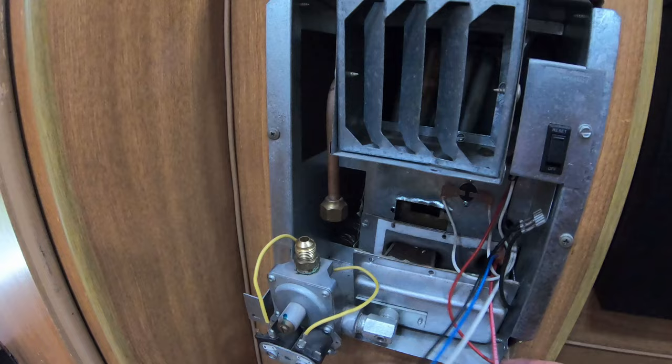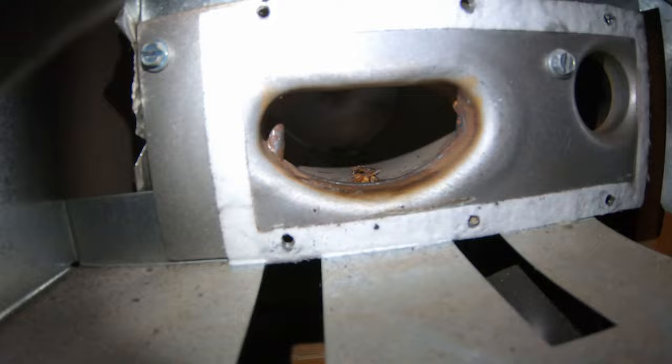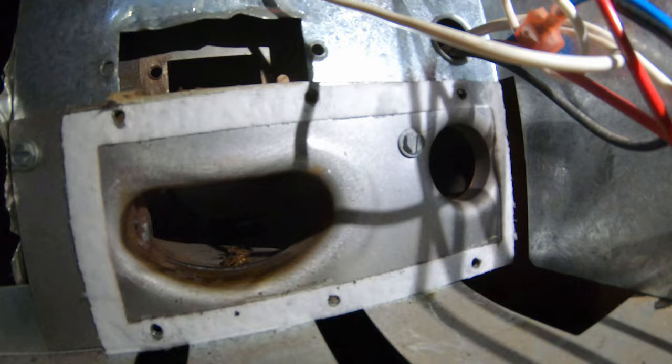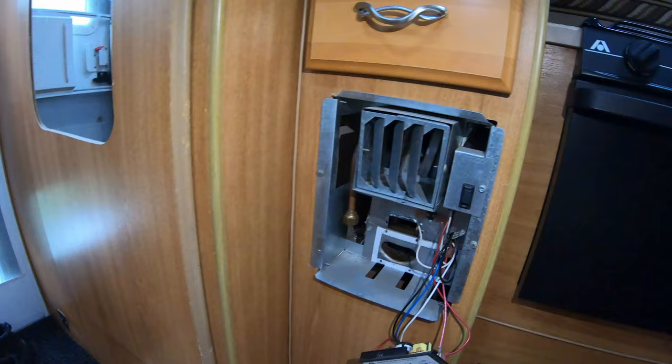The reds are on the outside and the yellows stay there. You could take all these wires off if you want. Boom — that is what our burner looks like. A little something on there — we'll go take that into the garage. Now you can get a good look inside the combustion chamber. It does look like there are some flies and debris on the bottom, so I'll clean that stuff up, but nothing else out of the ordinary. Looks pretty tight in there.